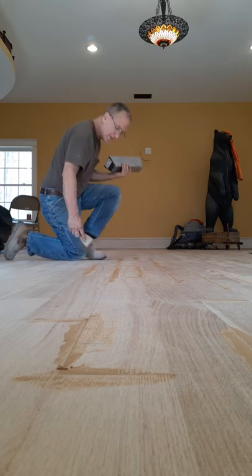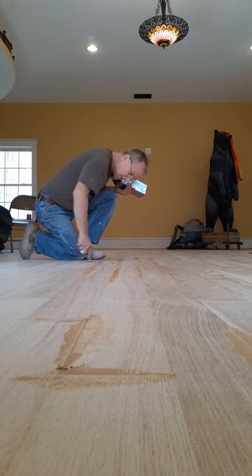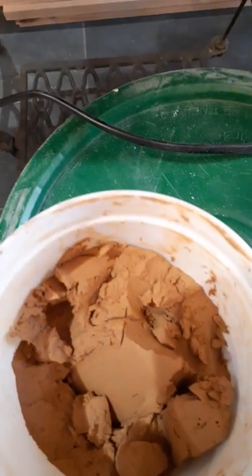Man, I'm really pushing hard. I had to wrap my finger with tape — that's not anything I've ever done pulling knives before, and I've run quite a bit of mud. This stuff is hard to work; it takes a lot of pressure to push it in there. That Good Filler wood filler — I got the recommendation on Reddit. That stuff is just like Virginia clay. It says add water if needed — yeah, you definitely need to add water. That ain't no joke. It's not creamy, it's not thick like pancake batter, it's like clay, straight up. But once you get a little water into it, it's toolable. You're not going to use it straight out of the bucket — no way.